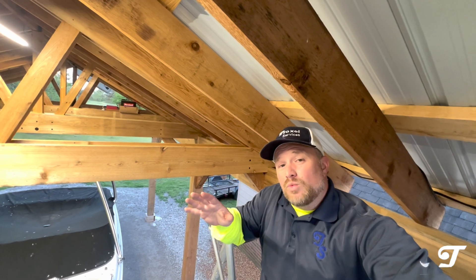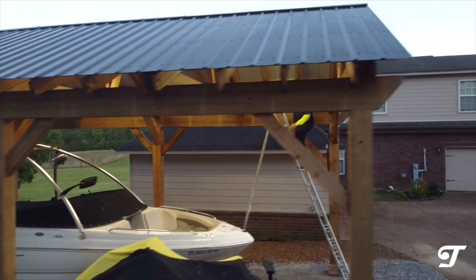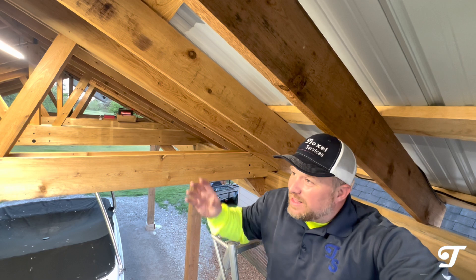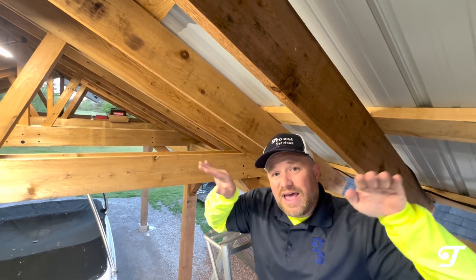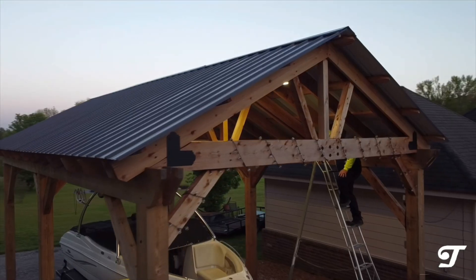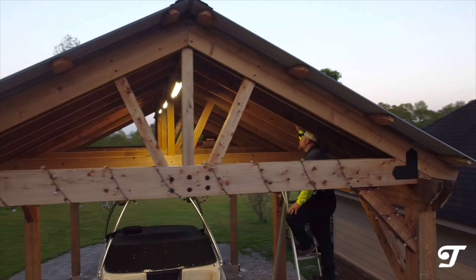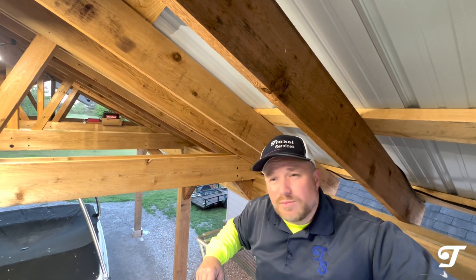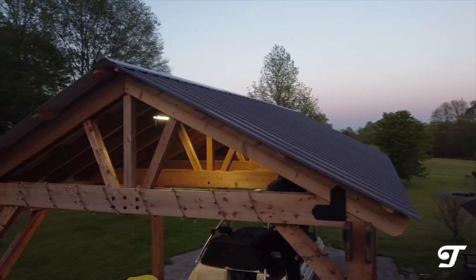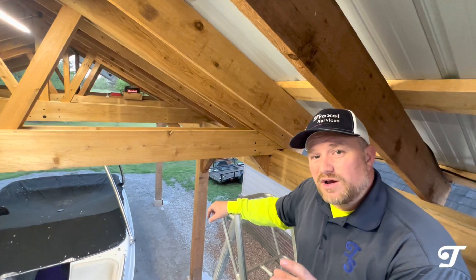Over the past five months we've gone through heavy windstorms — 40 to 45 mile-an-hour winds — and I see no defects at all to this metal roof. Partly because we didn't have it overhang too far, it connected to the end purlins really well with no wiggle room, and we put just the right number of screws in the roof. The ridge cap is all perfectly intact — this structure is holding up really well.